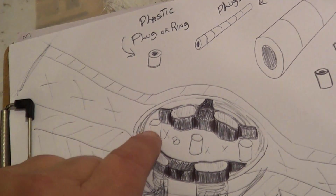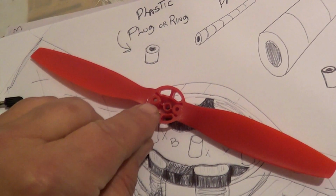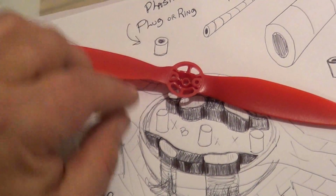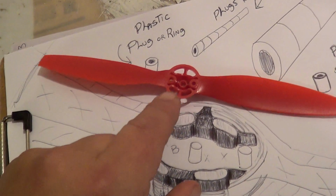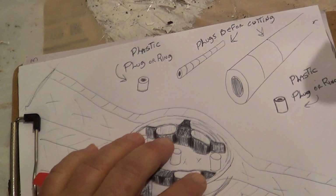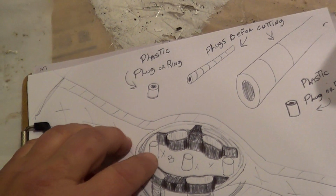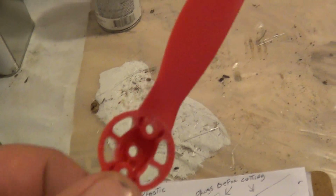They take these little pieces and they drop them on these little tubes, which is this little hole and that little hole, and they have one in the middle. These are metal dowels that stick up that make the little air holes. Well, they drop this little plug on, then they heat up the mold, they drop new plastic in, and they expect the plastic to fuse to these little plugs. Let me show you what I'm talking about.